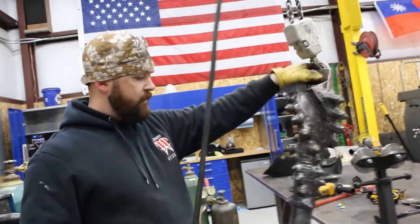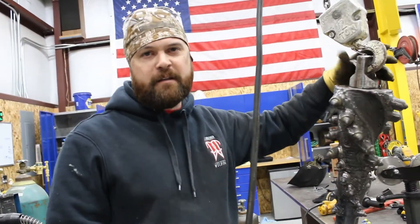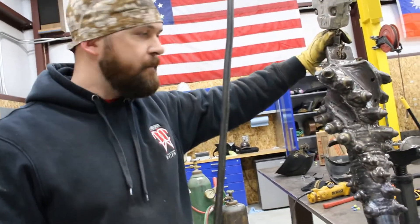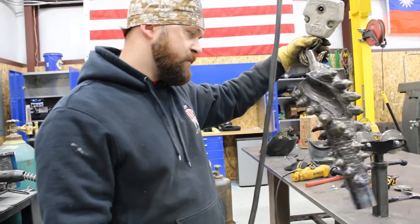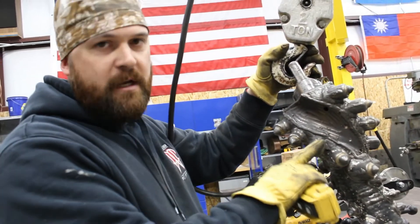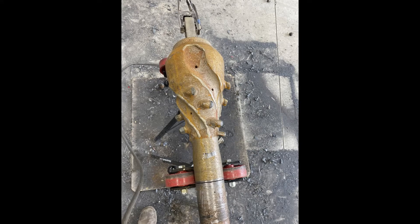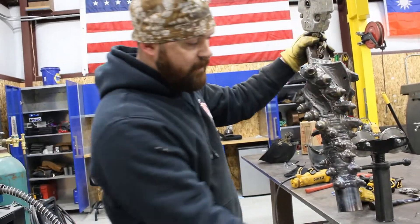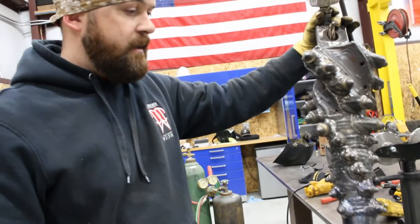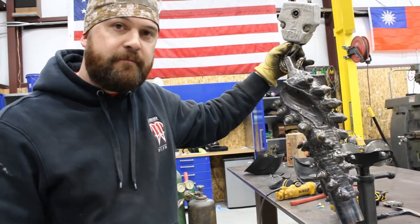So we got our reamer done. We hit it with a wire wheel - you don't really need to do that, because after they run it through the ground for about five minutes all the spatter and burrs are knocked off anyway - but I'm just kind of anal about sending it to the customer looking nice. Just some history: this reamer has been rebuilt before; these teeth right here have never touched the dirt. They brought me the reamer, I stripped it completely down, welded new teeth on it, hard faced it, sent it back to the customer. Well, they wanted to replace the shank and couldn't get it off, so he brought it back and that's why he wanted me to weld the new shank on, overlay it, weld more teeth on it, hard face it. And there you have it - thanks for watching.